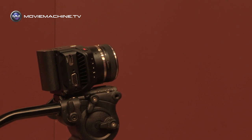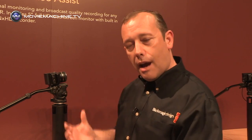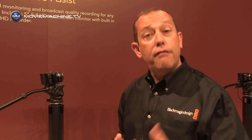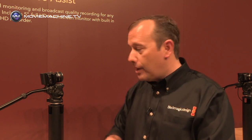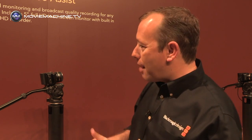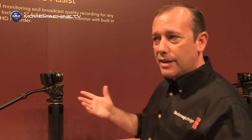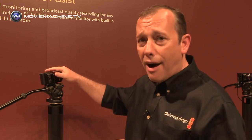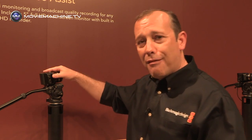The reason for making the camera so small is that it's designed to be situated anywhere you may want to put it — mounted up high in the air or hidden into a set. We have a lot of people use our existing cameras within vehicles or on a car mount, and this is the perfect sized camera for that job. It's a great crash camera or B camera, and the quality is absolutely superb — full 1920x1080 HD on a super 16 size sensor — and it includes raw and ProRes recording direct to the SD card.